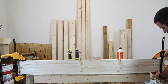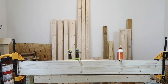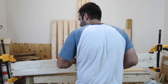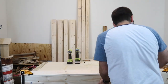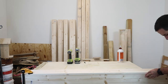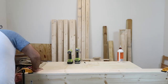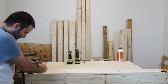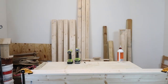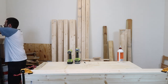All I did was place some glue so the boards went against each other, clamp them down, make sure they're straight, and they're good to go. For the screws, I decided to drive them from the bottom side so you won't be able to see them as much, and I'm going to paint over them at the end. All I did was drill down some pilot holes, countersink, and put in your screws, and that is pretty much it.